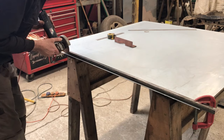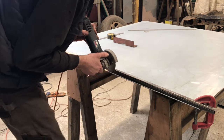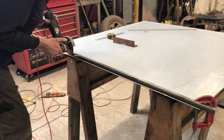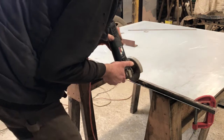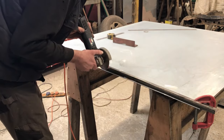Notice how I am cutting the metal in small depths of cut, back and forth, without going all the way through. The reason for this is the disc lasts much longer this way. If you cut at full depth right through, I would probably use a whole disc to cut this length. The guide allows me to do this as freely as I would completely freehand. I like the fact that I don't have to worry about following a scribe line carefully.